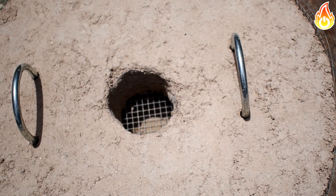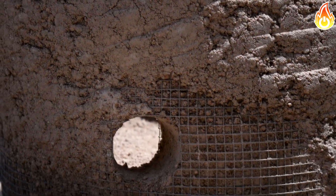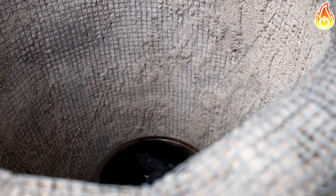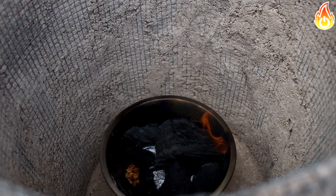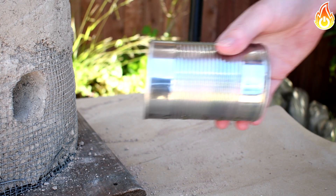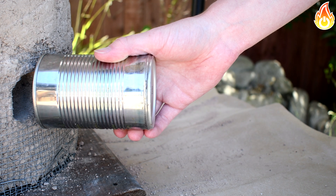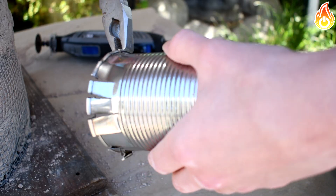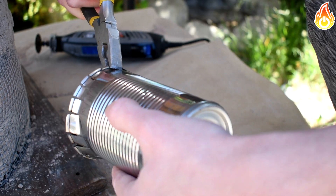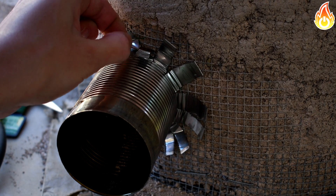With the lid and lining finished, it was time to let everything dry slowly. I let mine dry slightly covered for about three weeks in a cool, shady place. After two weeks I came back and lit a small fire inside to make sure it was dry, letting it burn for about eight to nine hours. Since we're using vermiculite insulation, we don't want it leaking out of the hole, so I added a steel can over the hole to block the vermiculite. I cut strips into the can to match the curvature of the lining, then attached it with steel wire.